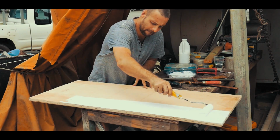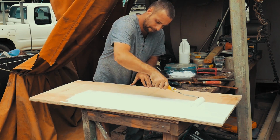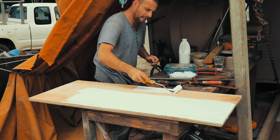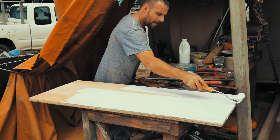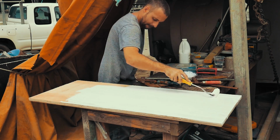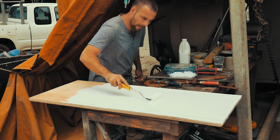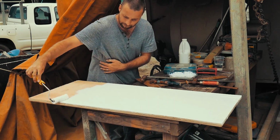So we started with two layers of half inch thick plywood and laminated these two together, and then once it was all dried we cleaned it up, routed the edges, and obviously painted it, and we're left with a pretty basic plain flat white board. It's an inch thick, so it's nice and thick. All of our fastenings are going to be 3/4 inch or shorter, so that way we're completely safe and we're not going to tap out on any metal or anything like that. And being wood, it's completely non-conductive. So it's a really safe medium to start bolting all of our gear to.